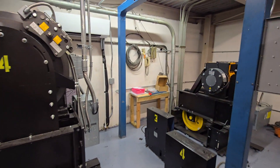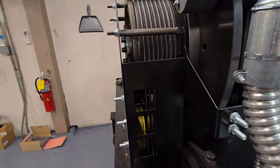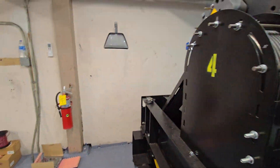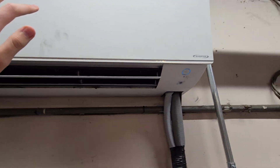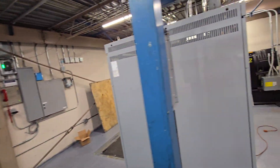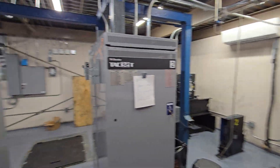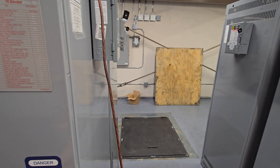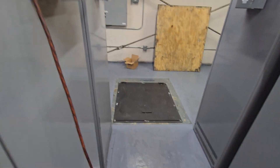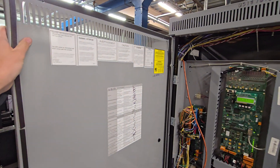Take a look at the service elevator's VFD — it's going to be different. There's a lot of airflow coming from here. These ACs are probably overkill as they were specced for the old equipment pre-mod. Here we go — this is the controller for the service car.